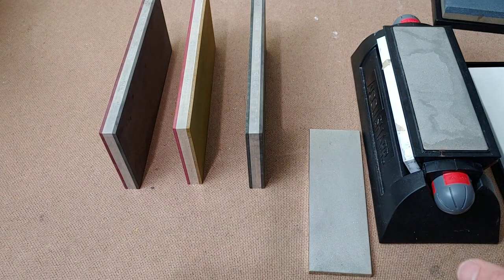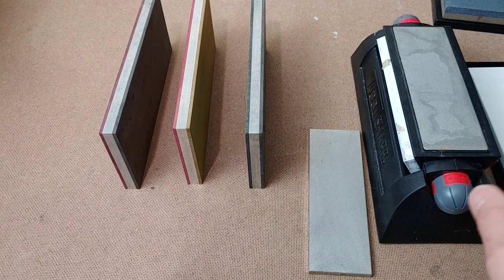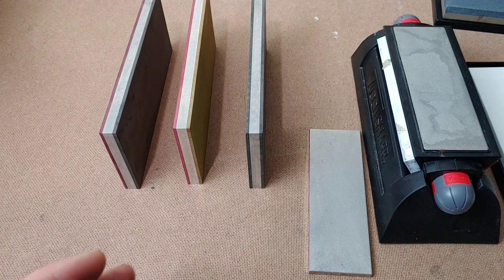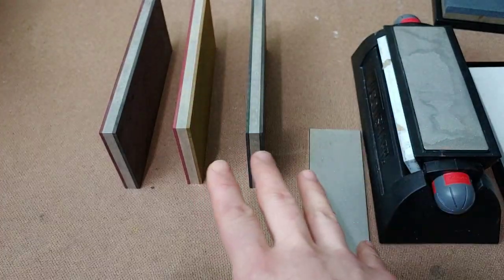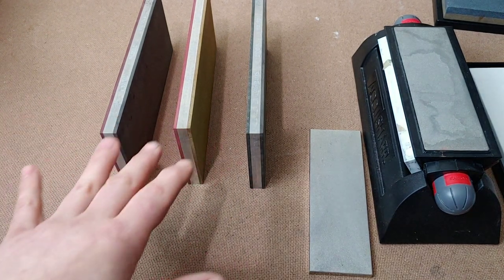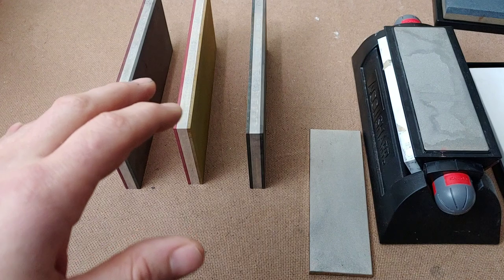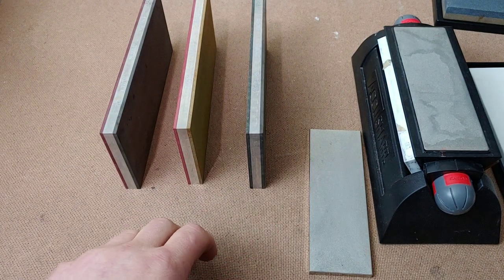You can sharpen on ceramic, but it's a lot more difficult — it mostly just refines steel. You want your edge already sharp when you go onto a ceramic; it basically just refines and massages the steel nice and flat and polished. This actually cuts it and removes steel to the point of polish or sharpening. So the good things about these stones: they cut any steel, especially the super steels. They are expensive, but they last a very, very long time, and they are very easy to use.